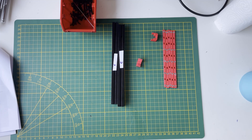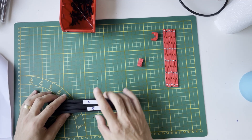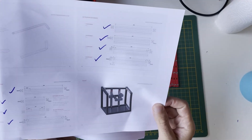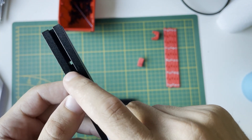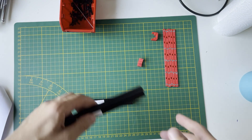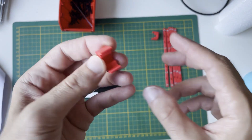The rails are finished and I sorted them by axis: the best for X, second best for Y, and the worst for Z. Now we will install the carriages for the Y rails, for which we need to use E-frames as defined in the manual — pages 10 and 11. The E-frame has one hole with an offset of 29.5 millimeters. All of them need to be tapped, and I also prepared the rail installation jigs.